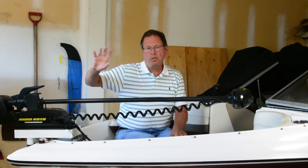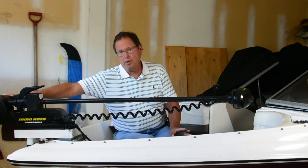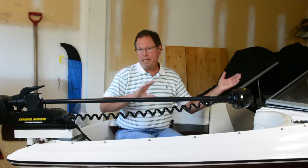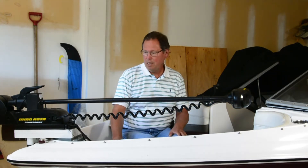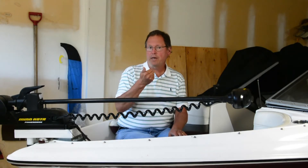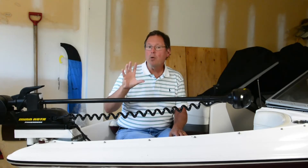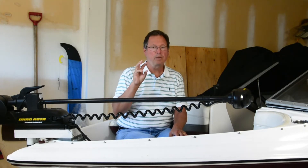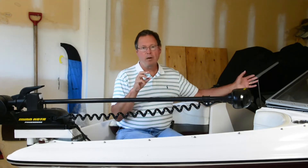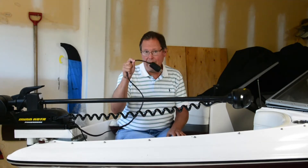Going back to some simple numbers — say we're talking about 600 watts that the system is trying to draw; that's your 12 volts times your 50 amps. So 600 watts is going into the system — where is it going? The cabling itself is going to drop one and a half volts, you're going to have 50 amps, so that works out to a power loss. And this is important: keep thinking about power, don't just think about volts or amps.